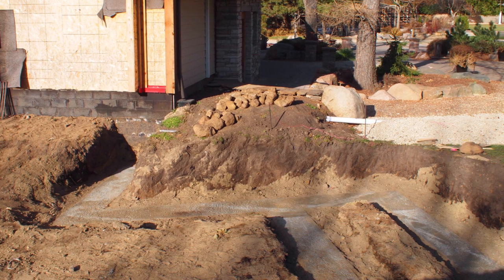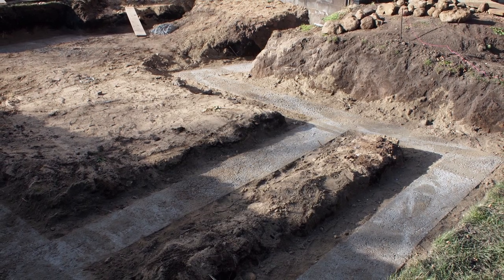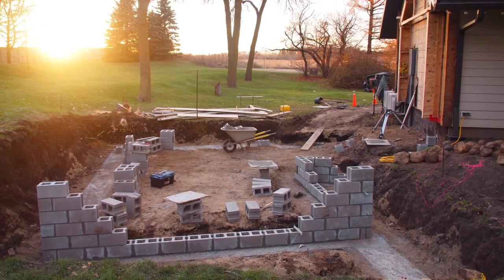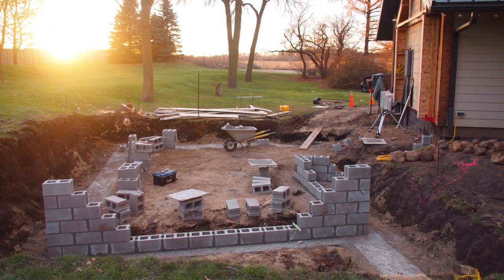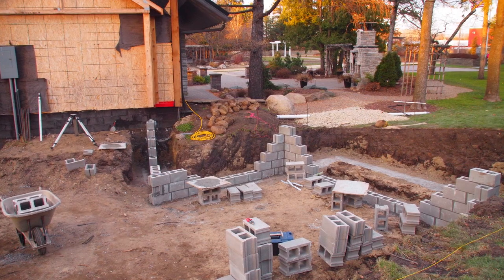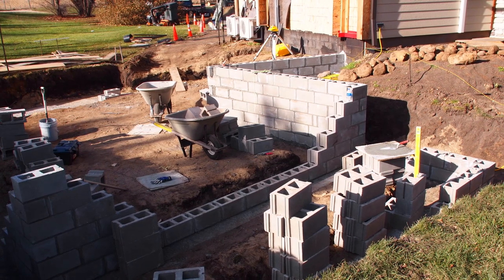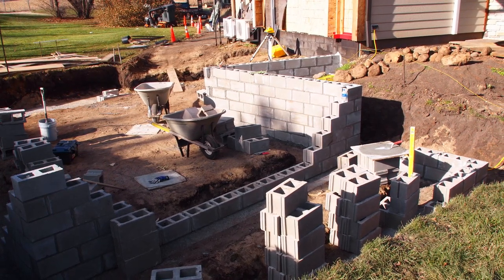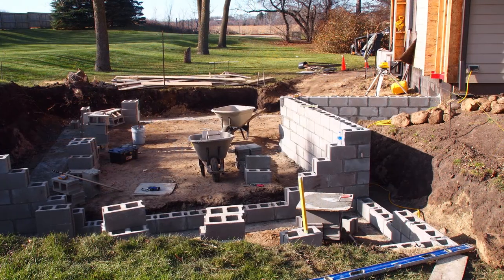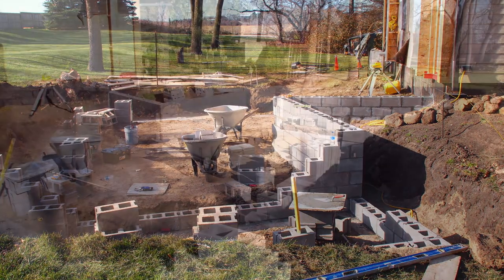At night in the fall, we were starting to get a little bit of frost — not freezing yet, but just getting frost in the fall. We were trying to get some of the cold block work on top of the footing. So we squared up the front part of the building itself, not so much the porch, but we did the building and got that nice and square. Then to the front of the building block, we started to put in the porch block.